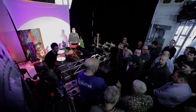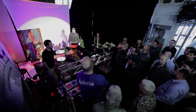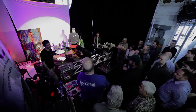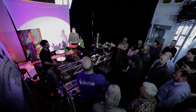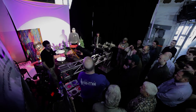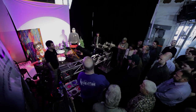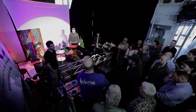Question: Any benefits or differences running these fixtures on 120V versus 208V? Pretty much all the LED fixtures you'll find are 120V, but most of their power supplies are auto-sensing — 110 to 240 or whatever — so you're not going to see any significant change in output; they're not going to get brighter on higher voltage. There's also no meaningful difference in longevity.